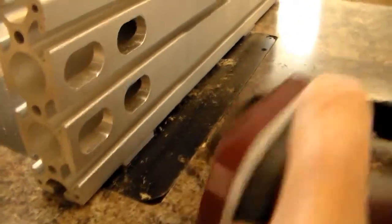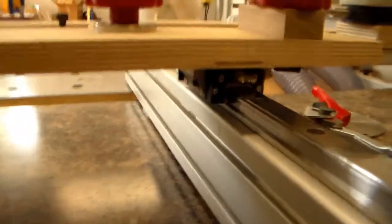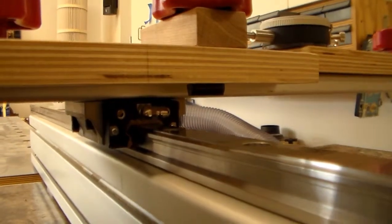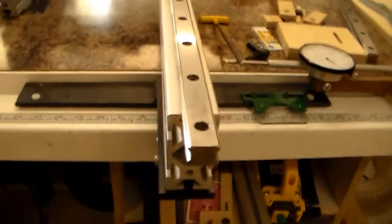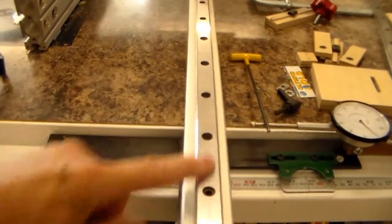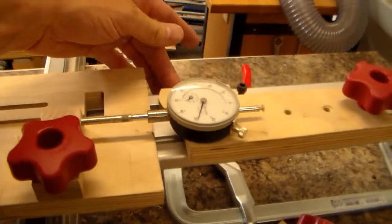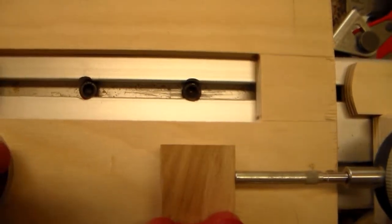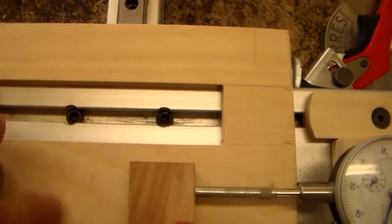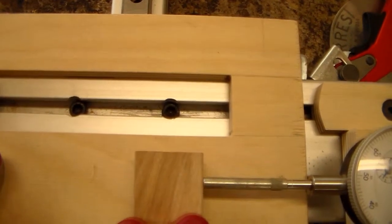That was because I put the UHMW bearing guides on the bottom. Okay. Underneath, then you can see the THK bearing, which is now mounted in the rail, mounted to the extrusion here. Then the bearing, then our piece of 16 by 80, which is mounted to the bearing through these holes. There's two more here that you can't see. That mounts this extrusion perpendicular to that bearing.